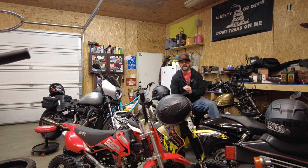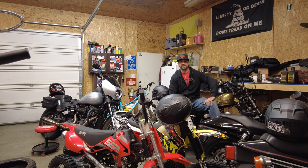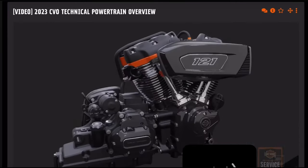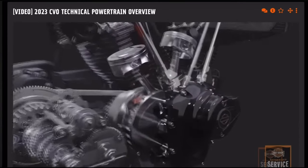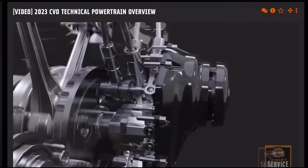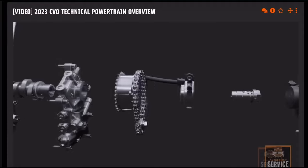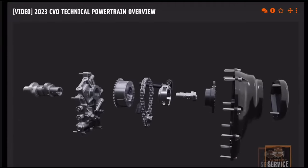I put the video up because I feel like the variable valve timing is going to be absolutely game changing going forward for Harley Davidson. I've only been riding Harley for about eight years. They mentioned in the video how the car industry has been using variable valve timing for the last decade. The 121 VVT system is neatly packaged in the cam compartment and is of a similar design to the Revolution Max VVT engine. The proven base design has been applied in the automotive sector for over a decade and was downsized in partnership with Borg Warner for use on a Harley Davidson pushrod engine.